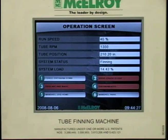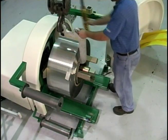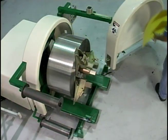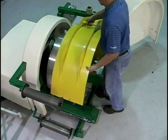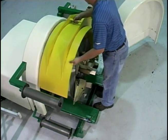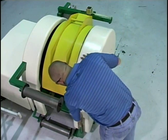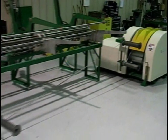Optional equipment is available for your finning machine line as well. McElroy's level-wound payoff system tucks neatly below the bare tube rack upstream of the existing slit payoff table, or can be positioned at the end of the rack. Hardware for placement at the end or on either side of the rack is included with the payoff. Approximately 90 inches (2,286 millimeters) of clear unobstructed area beyond the active tube centerline is required to allow the safety guard to swing open for coil loading and unloading. Designed to handle coils of fin stock of up to 1,200 pounds and a maximum outside diameter of 36 inches, you reduce the downtime required for handling, loading, and feeding of the fin stock.